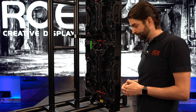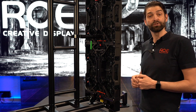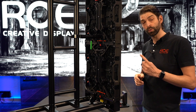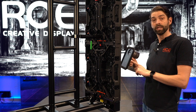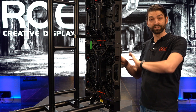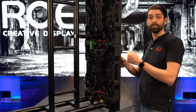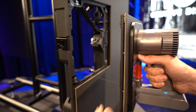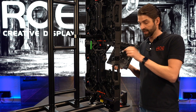So how do you service a Ruby panel? In case of an LED failure, it's really easy to change the module. You have two options. Option one: you remove it from the front. In this case, you can use the vacuum tool — it's a really convenient tool. You place it on the side of the module, make sure it's centered on the module, close the button, and it will suck itself to the module, and you pull it out in a straight line. Please be aware of the safety cable.